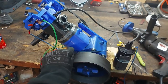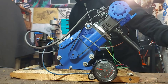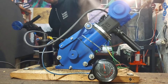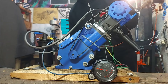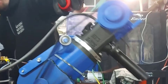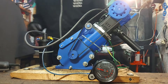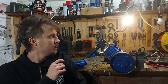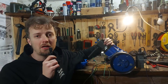Yet another cable failure — I fixed it and secured it to the cylinder body, and we're back to testing. That was a decent run but something went wrong. Those intake flames are enough of a sign of a timing jump. Just to be sure I checked everything again, and it did in fact jump timing. So after realizing the engine jumped timing, I decided to disassemble the whole thing to make sure we don't have any damage to the valves or anything else that could lead to a catastrophic failure.